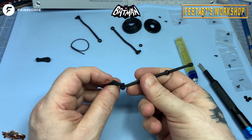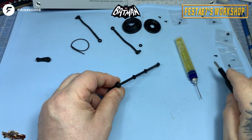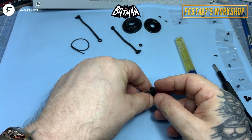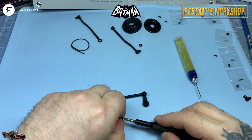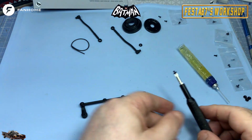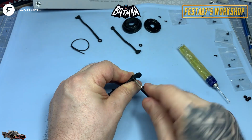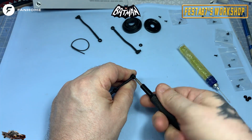And that moves nice and freely. Can go a little bit tighter, like so. That's going nowhere, okay? That's what you want. And do the same the other side there. Feed that one in, like so. It's actually a bit looser, that one, so that doesn't need any oil in that joint. Put that on the end of the screwdriver, a little bit of oil on the screw because we are going into the die cast, and then we'll do the same as what we just did. Just rest that on the edge of my thumb, and then we can send that home. And I tend to do a couple of turns, back it off, couple of turns, back it off, just in case you need to recut the thread.